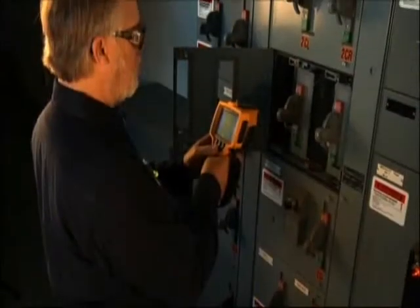About two and a half years ago, we had a new plant leader that had come in, and we had a problem on the line — a motor that had burnt a lead off. While I was up there working on the motor, our new plant leader came up and asked me, isn't there a better way of finding this before it breaks down? With my background with infrared, I knew there were cameras out there that we could use to detect hot conditions in motor wiring, and that's what led us to get into infrared.